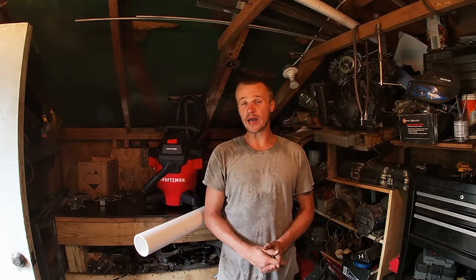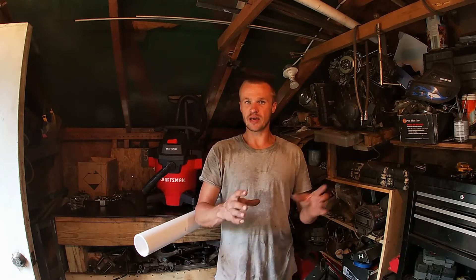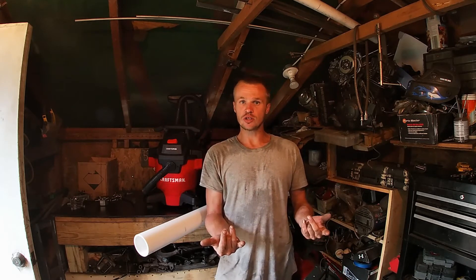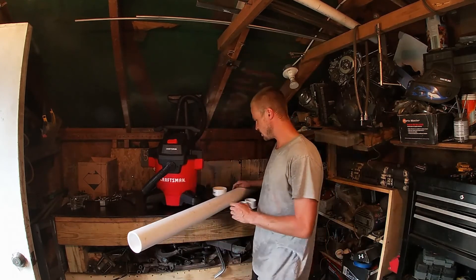Hey, what's up YouTube. I just got back from the hardware store and today I'm going to show you guys how to make your own homemade flow bench. I play around with a lot of small engines and I'm always trying to drag more power out of them. The best way to do that is with the cylinder head — your cylinder head is really your engine, everything else is to back it up and be in tune with it. Your bottom end is your strength, so to make more power you've got to port, polish, shape, put bigger valves in, stronger valve springs. There's a lot of little things you've got to do to your cylinder head to get it just right. So how they do that is they put that cylinder head on a flow bench, and that flow bench tells them if the change they made is helping it or not. So I picked some stuff up from the hardware store — I got some PVC pipe and a few different fittings.